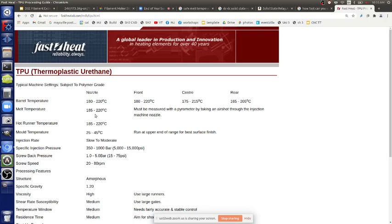But it shouldn't, given that we have the hottest point at the lowest point of the nozzle, the flow rate is going to be dictated by how easily it falls down and flows through, right? And that's going to dictate how everything else moves too. Looking at it before, we didn't have a consistent long run, but the extrusion speed seems to be, it might just work. Yeah, it may all come out in a wash.